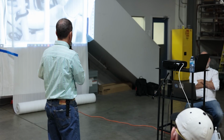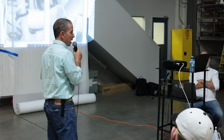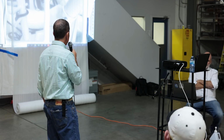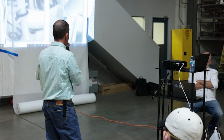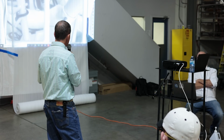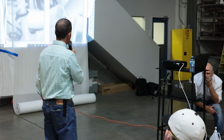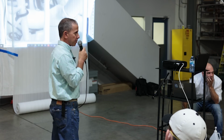The fast pin, as we've discussed, that's hard to deal with. To the extent that you could not have paint on that, I would have just not painted that flange there. I'd have left a nice tape line there, and now you're not going to have an issue with paint being damaged there. You're always going to have water getting trapped in there, and there's a bushing in there, I'm presuming, maybe a plastic bushing, or it looks like there's something in there. No bushing. No bushing, yeah. So, painted aluminum against painted aluminum and movement, the paint's going to get damaged. And so again, I would just eliminate paint in those areas and have a nice, neat paint line that will hold up much better.